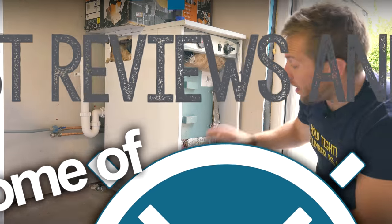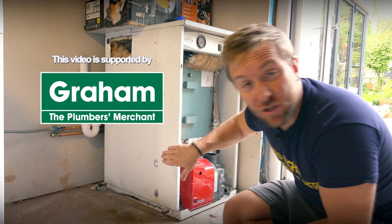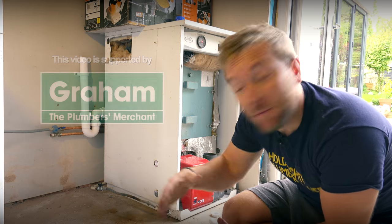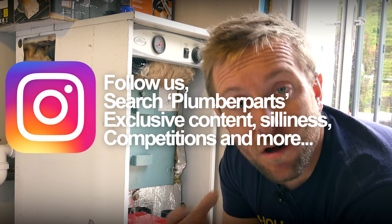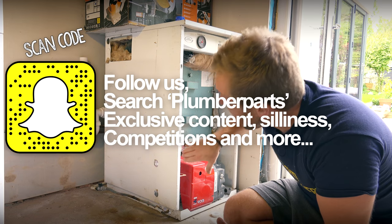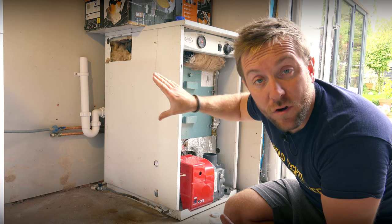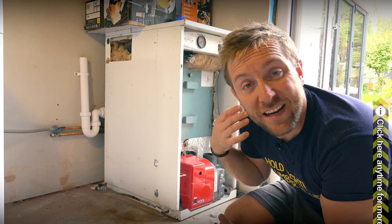Here's our problem. Our condense outlet comes out from here, and what used to happen is it used to run outside to a temporary limescale gully just outside there. That was fine because it could run downhill and go outside. But we don't want to be running to our limescale gully anymore, and I thought this is a great opportunity for us to show you how we can use the washing machine waste we've got behind us that goes off to our normal 4-inch stack and then off to our main drains to actually get rid of our condense internally.